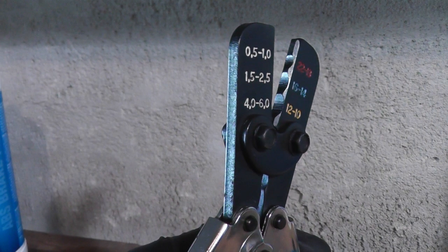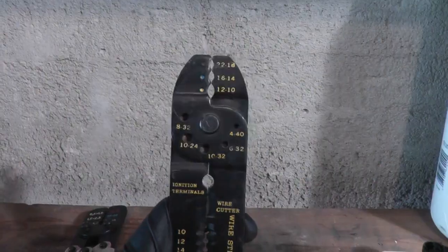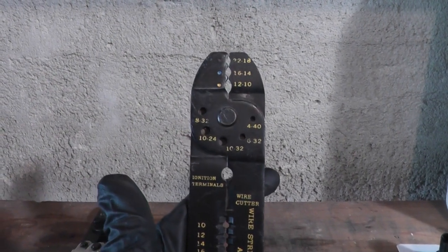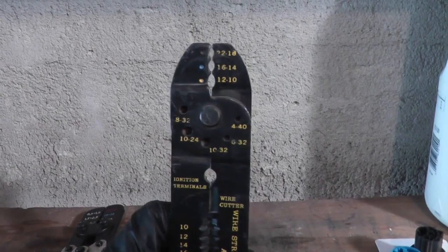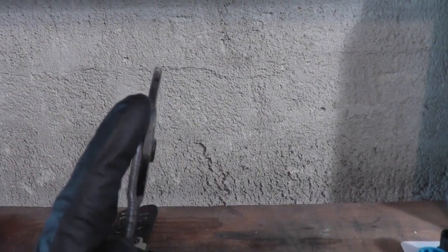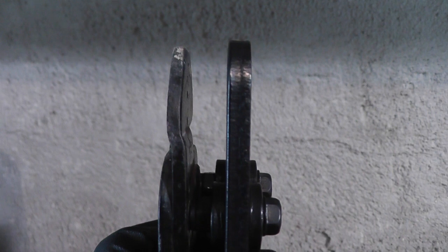You'll see that the dies have been machined with a smooth edge, so that they won't tear through the heat shrink tubing on the butt connectors. This is the type of tool you don't want to use — these tools make a very poor quality crimp. You'll notice when I put the jaws of this tool side by side with the jaws of the quality tool, how much thinner the jaws are. The good quality crimper's wider jaws will create a wider crimp band and a high quality crimp.